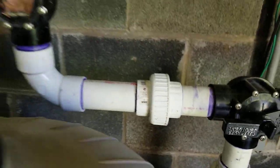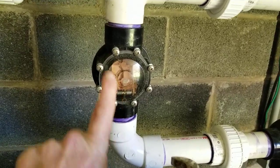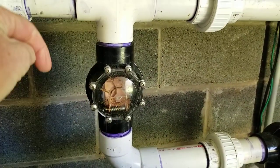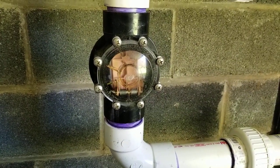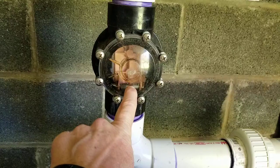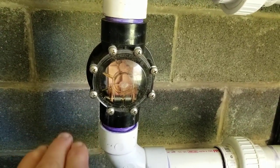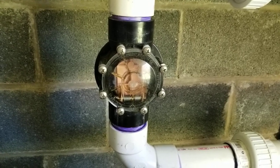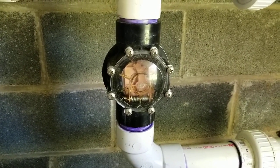I come over here, come up, and I have a check valve. This check valve allows water to flow upward through it but does not allow water to come downward. That little pinkish-orangish thing in there is a little flapper that's spring loaded — there's a little torsional spring. So when the flow is reduced, that will close up, and if I turn off my pump, it will go closed and not allow any water to flow downward.